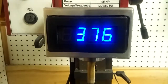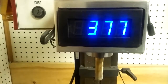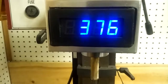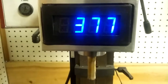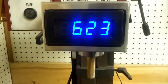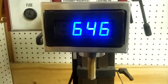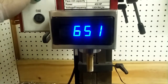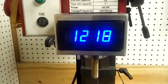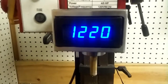I think on the first video I didn't give it enough time — it takes a couple seconds for the readout to catch up with the RPM of the spindle. There we go, it's pretty steady. And that's in low gear, that's all the way up in low gear.